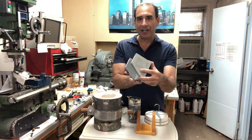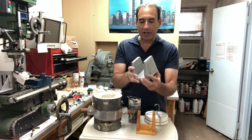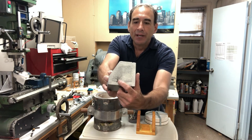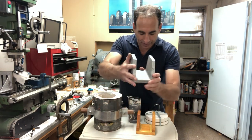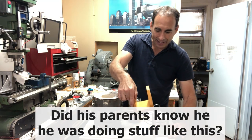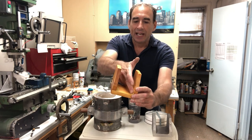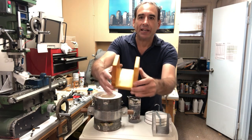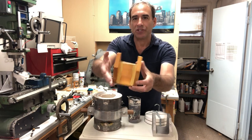This is one of the castings I created back then. It came out pretty well — you can see there are some problems with the casting, but pretty good for 10th grade. I would make my patterns just out of wood, with some caulking for the fillets, and then coat it with shellac.